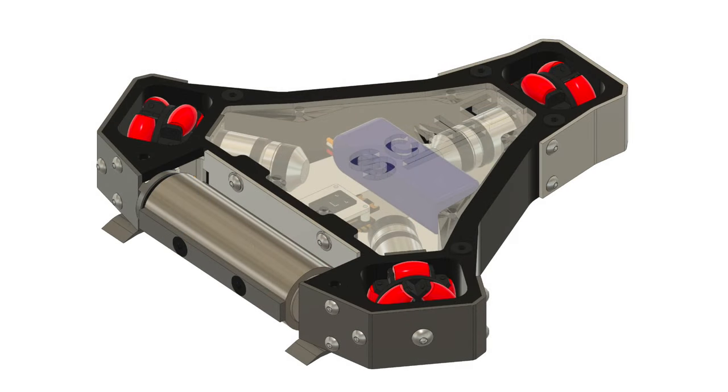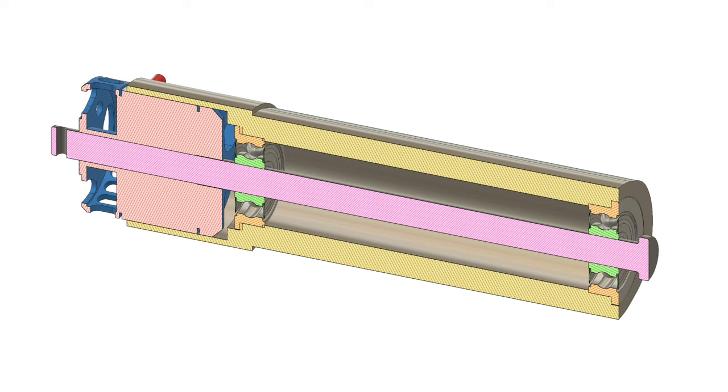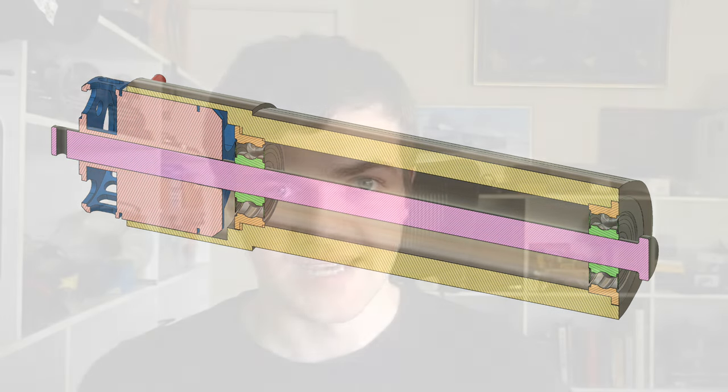The initial CAD concept was laid out, including my first concept for a hub motor weapon, which I still use derivatives of today. Idea one was to basically copy the Riobots picture with a drone motor on one side and a bearing support on the other. With hindsight, this was never going to hold up in a combat robot setting at all, at Beetleweight scale at least, and so with some other builders' advice, I arrived on close to the final version. This uses a dedicated dead axle with two ball bearings and a cut-up drone motor on one side, to allow the magnet ring to be embedded in the drum, separate from the stator.